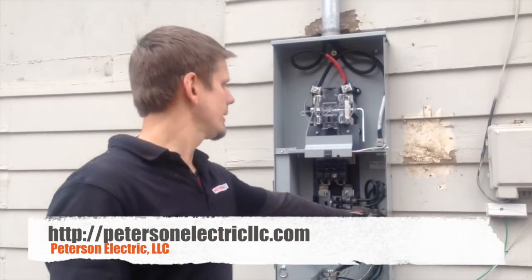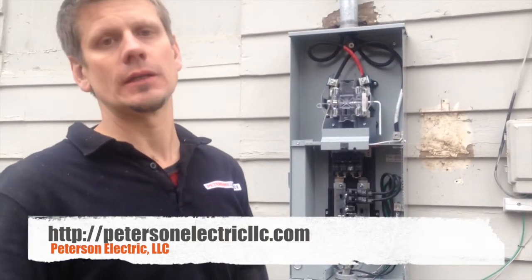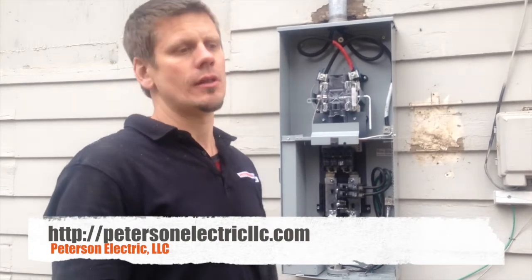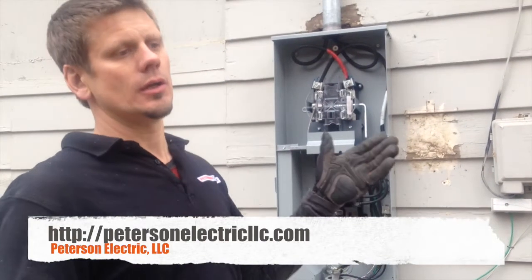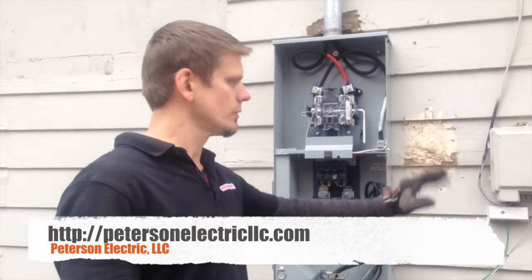And bonding them right here is Article 250.64, where we can take any of our grounding electrodes, which talks about in Article 250.52. In 54, it talks about how we've got to have our two ground rods as our supplementary ground, and our cold water bond as our primary, and of course our new grounding bridge rule.